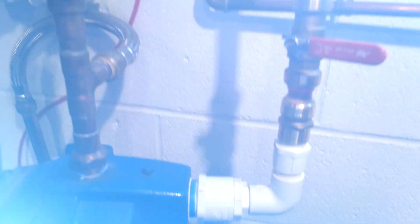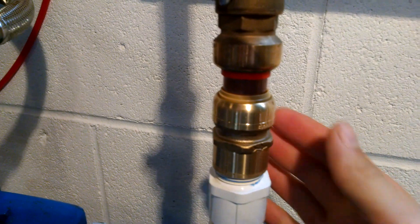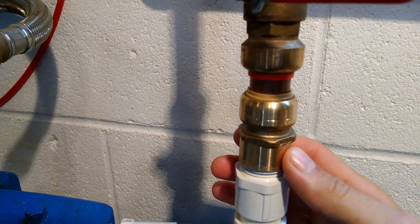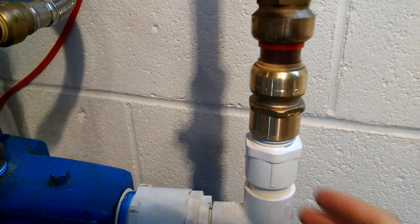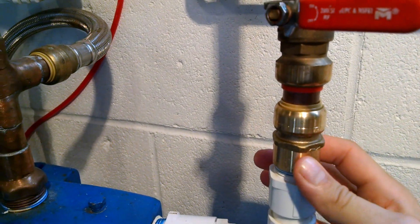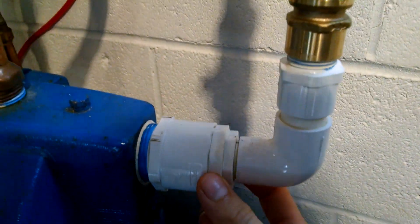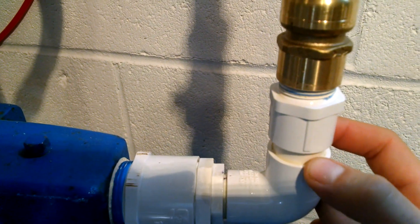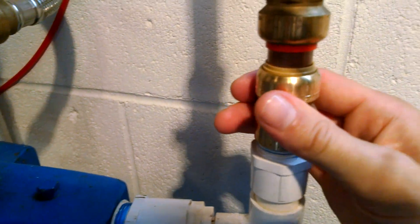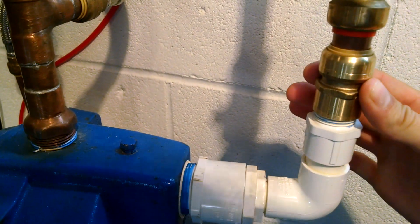I'm going to make some other changes, but for now this is the way I did it. The 3/4 inch PEX goes into the SharkBite, and then on the other side I've got a little piece of copper — probably a little too small because you need to get in there with a tool to remove it — and then another SharkBite with a 3/4 inch female. Generally speaking, if you're going to adapt from brass to PVC, you want the brass as the female and the PVC as the male, so you can screw it in nice and tight without worrying about cracking. So I have a 1-1/4 inch male adapted down to 1 inch, then adapted down to 3/4 inch, with a piece of 3/4 inch PVC, a 3/4 inch PVC elbow, another piece of PVC, and then the 3/4 inch male screwed into the adapter. This is the most logical and cheap way I could figure out. This piece here was like $8 at Home Depot.